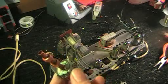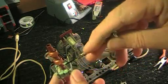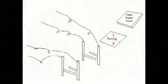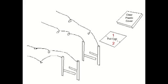From this angle I don't know if you can see, but on the base, the very top of this base right here is a clear plastic cover that's probably about an eighth of an inch thick. Just take a closer look at how the actual capacitor is built into the system. As you can see here, there's four lugs — each lug has an arm that goes across it. One lug has the bottom arm, one lug has the top arm. That sheet of capacitors — there's actually two capacitors on there — it's a foil capacitor. It's going to go in between the top and bottom lug of both of those pairs of lugs, and it will fit in there just like that.